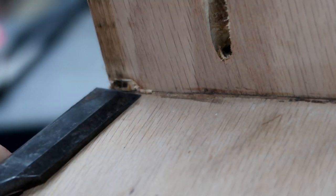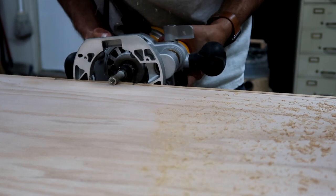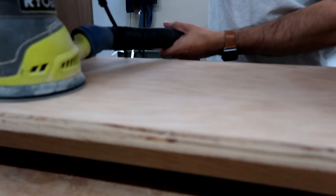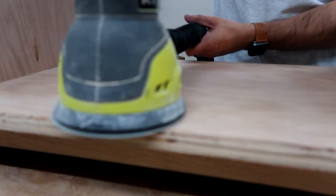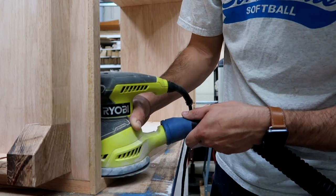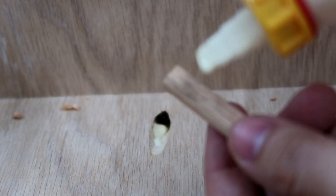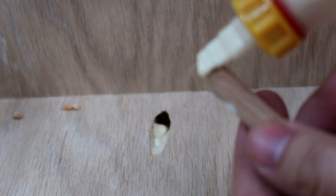And the reason why it would be a lot easier is because this is a big, 1/2-inch collet sized DeWalt router, and it's pretty hard to balance it just on that 3/4-inch edge that I have. Maybe if I had a palm router, it wouldn't be as bad. Maybe you wouldn't need to make sure the edge is on the plywood pieces before you assemble the whole carcass, but I don't have a palm router, and I just wasn't really thinking about it.